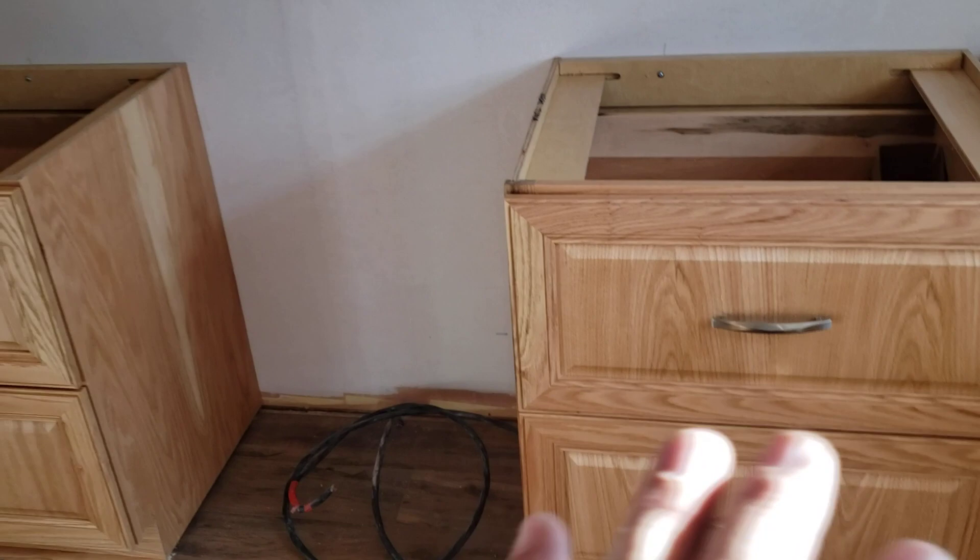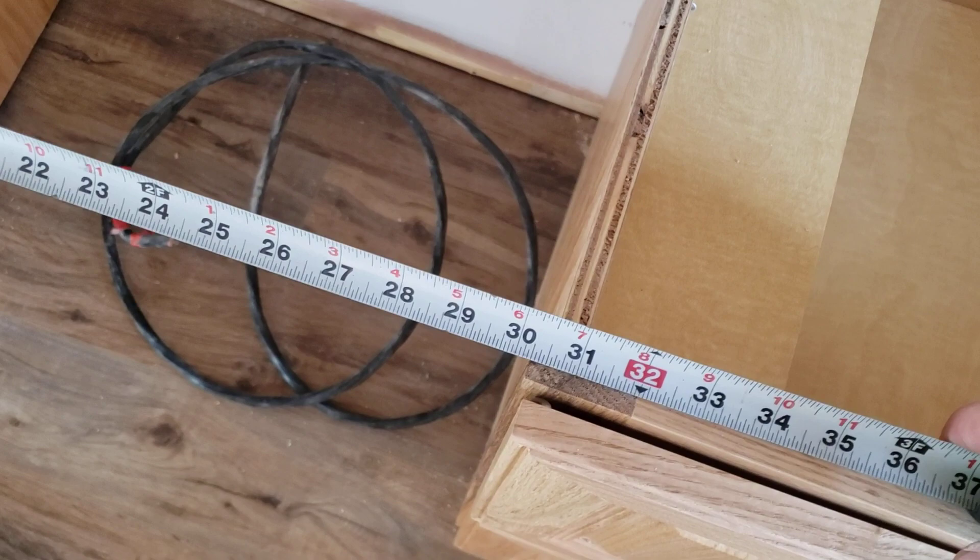Left-hand return door adjusted — the gap on it looks nice and clean. Double drawers here — most people want to have some drawer storage space in their kitchen and these big double drawers are the ticket for that. This is a freestanding stove, and for a freestanding stove we always leave about 30 and a quarter; this one's right at 30 and 3/16ths for the opening.